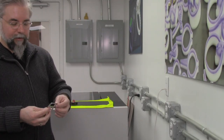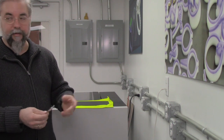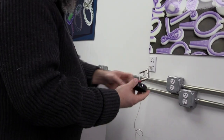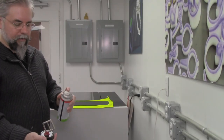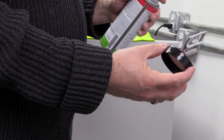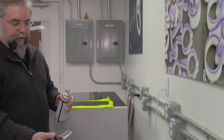And then what you can really do with it once you have it scanned. But in order to get there, I have to paint it up. This is a heavier piece, so it's really going into the wax there. I'm going to spray it with our whiteout. There's not a lot of details to lose, so I can go a little faster and be a little heavier with the spray on, but I still got to wait for it to dry.